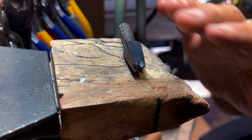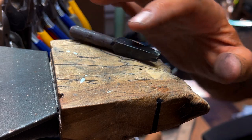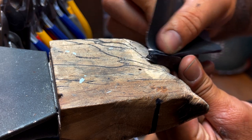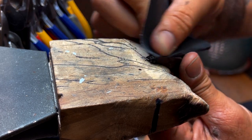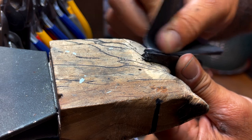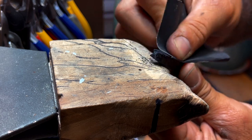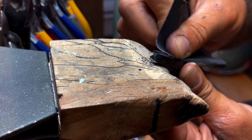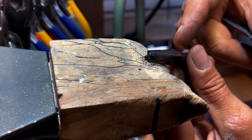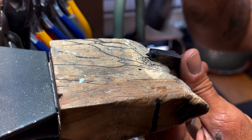So now we can clean up the stamp. I'm going to use sandpaper number one, which is I think 220, just to take off all the oxidation so we can see the next step clearly. Some people even polish it all the way. The idea is the shinier the steel is, the easier it is to see the colors for the next step, which is the tempering. At this stage, the stamp is very hard but also very brittle — if I was to use it the way it is, it would probably break.